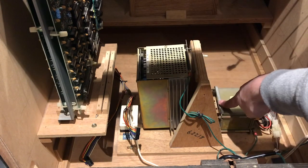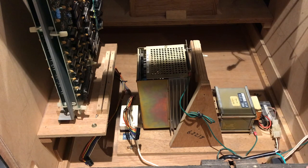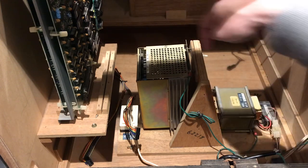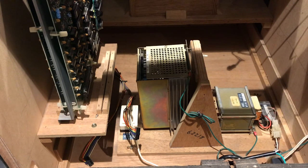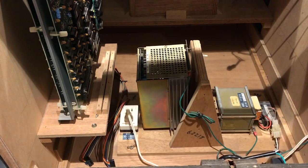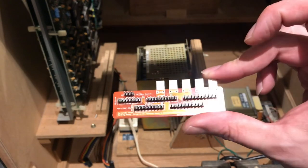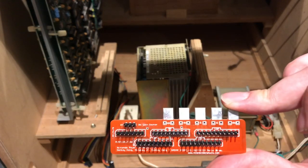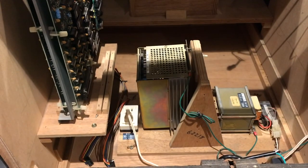What we're actually doing is going from AC from the wall, jumping off the existing connectors and going to our power supply. That way we're not hacking up the original wiring - I'm not cutting any connectors off, I'm keeping it original. You don't have to buy these boards if you want to cut your connectors, but I want to keep it nice and simple.